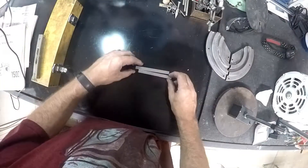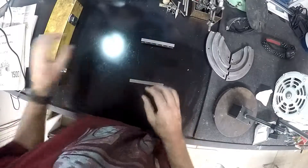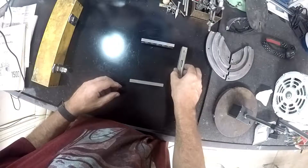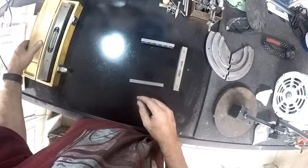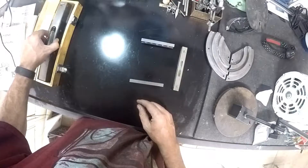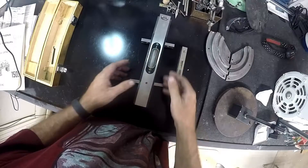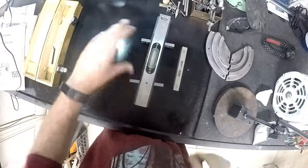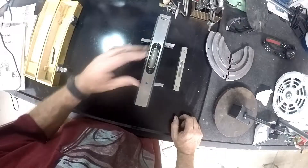I have these parallels I'll be able to use — I can set these across the ways. I have this little level here to check the level, and then I have this machinist's level that I'll use to validate across the ways. I'll go across the flat ways and level everything that way.